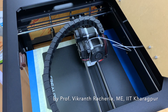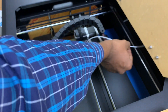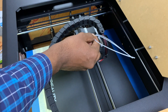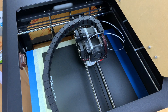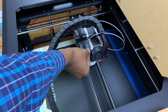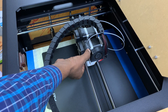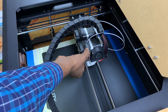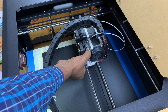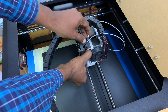The white filament has gotten broken, so I'm going to pull it out. The filament got cut, so it will have to be taken out from the extruder. To take out the filament, you need to press down on the extruder. When pressing down, you have to hold it from the bottom side — these rods are quite weak and can bend and permanently damage the machine.